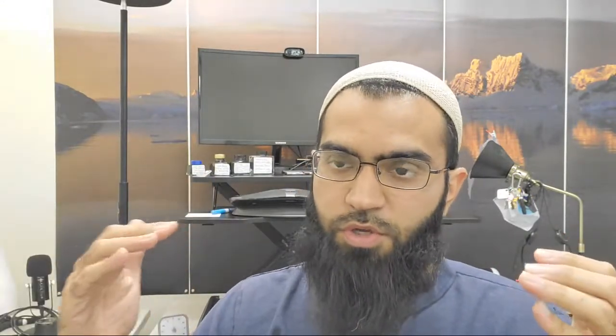And those spikes, those excessive spikes that happen around the resonance areas, are not actually the resonant mode you want to target. They're kind of byproducts of non-uniformities, of, let's say, tolerances not being perfectly matched, of other things in the system resonating that don't produce useful output, but are linked closely to your resonant mode. So you want to reduce those modes. You want to reduce their appearance for two reasons. One is so you don't get energy going off in other places, and that energy going off in other places causes heat inefficiency and also can cause fracture for those specific areas of your device that are excited very strongly by those spurious modes.